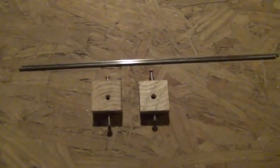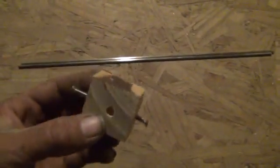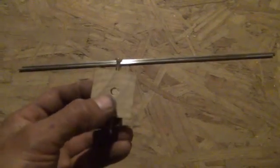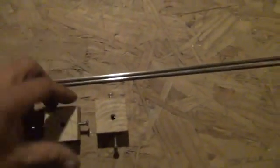We're working on our brushes now and how to hold the brushes onto our main drive shaft. I've come up with a little chunk of two-by-two that I've cut off and drilled a center hole through. This will go right over the drive shaft — it goes right here behind the shaft, and each one of these brush blocks sits one on each side.